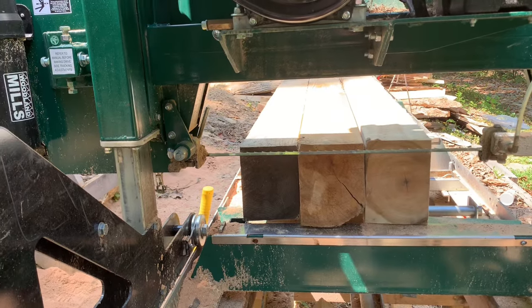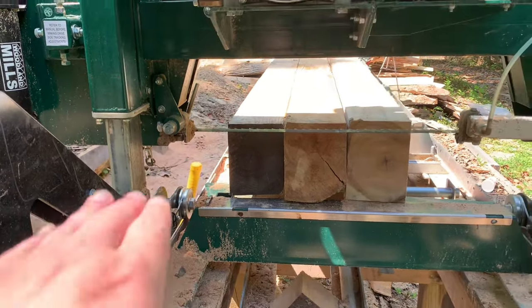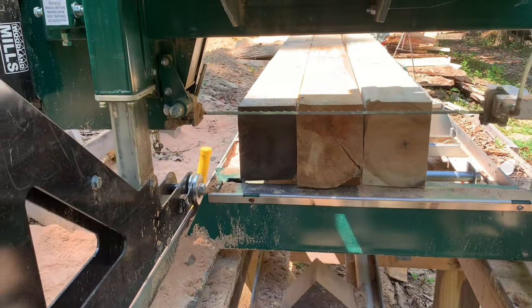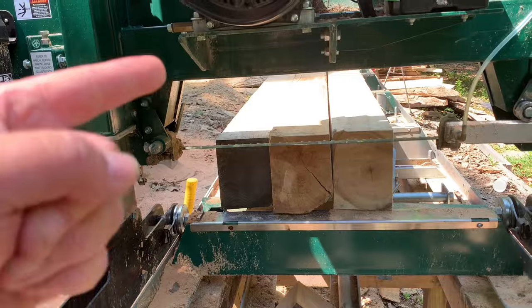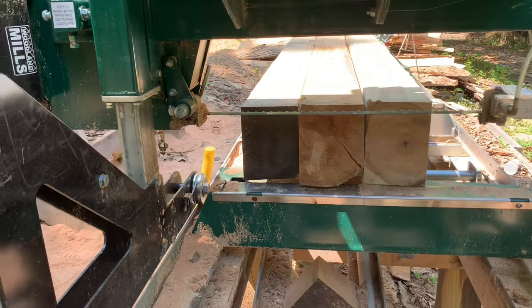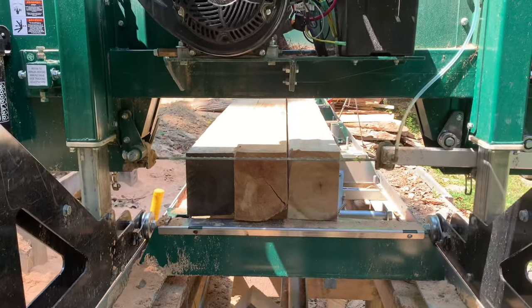Working face of the beams. It'll make sense once I start doing it. But yeah, I'm going to make them all level. If the underside undulates, that's fine with me. But I'll be chiseling and mortising and drawing on a finished sawn face, which I'll show you here.